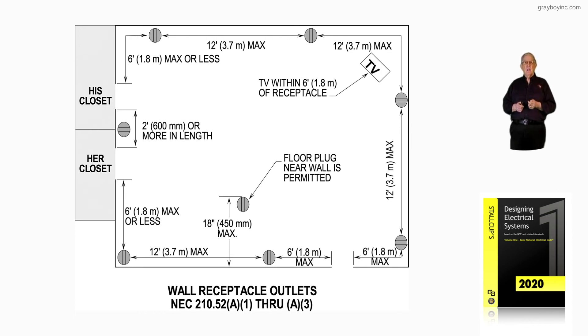That's 600 square feet for a 15-amp circuit or 800 square feet for a 20-amp circuit. Notice a receptacle in the floor near the wall — it's within 18 inches, not two foot, but 18 inches from the wall. That receptacle could also serve as a wall outlet. So figure 10-9 is basically showing the layout of a room with the number of receptacle outlets required based upon the conditions of use and the construction aspects of that room.